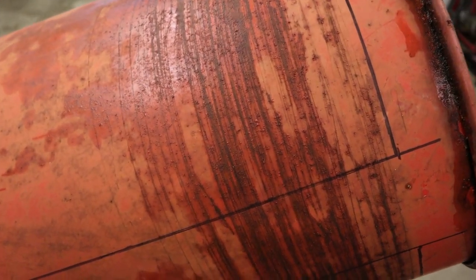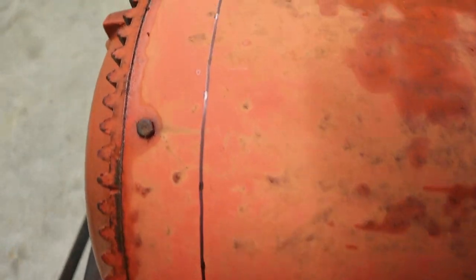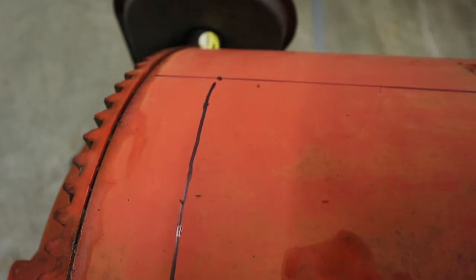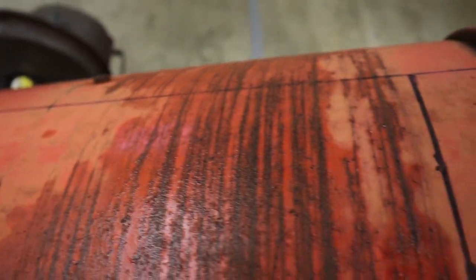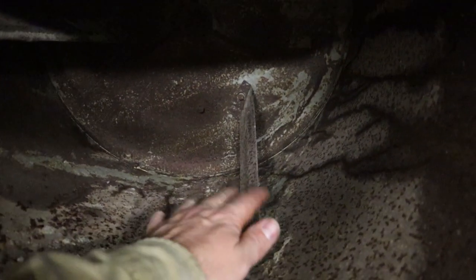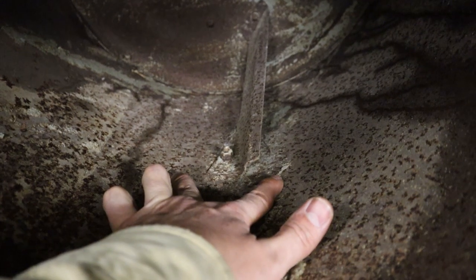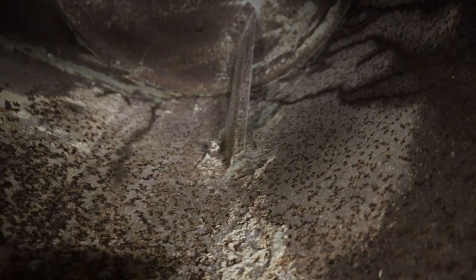Here are our lines to cut — two and a quarter from the bottom and two inches from the top. There are three sections we'll cut out. Here are the beater bars inside, so there'll be two inches remaining on each side of that bolt, giving a four-inch wide frame running top to bottom.